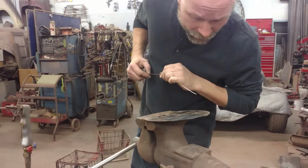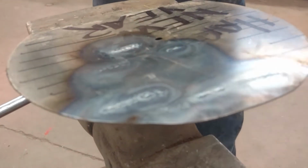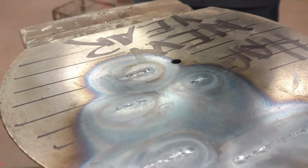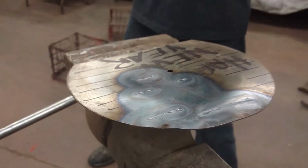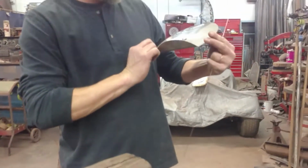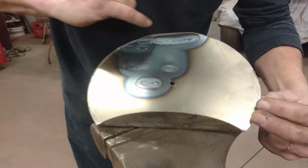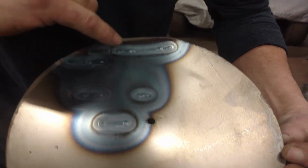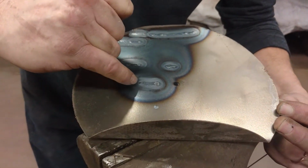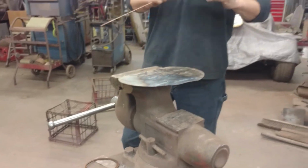And that is certainly not the prettiest weld I've ever done. I could do better. Same thing with adding a filler rod. Gas welding isn't going to look as neat as TIG. You do have some oxidation in there. You want to practice getting good penetration. What we're looking for is that slight little drop on the inside. Now that may have been a little bit too much, but it's right about there when it's actually getting to be about perfect. Practice in different positions.